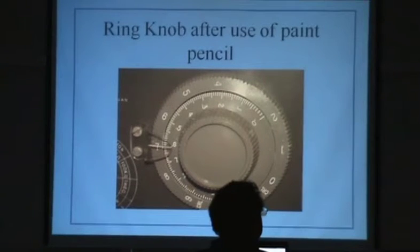I didn't get this slide into the slideshow, so I'm going to put it up here. There's essentially a heavy, pasty white paint that comes in a tube, like a very thick paste. You rub it across, it goes into the grooves, and then you take a nice soft cloth and gently, don't go nuts on me here, wipe it off, and it'll come completely off and do nothing but fill the spots in. There's one other trick to it, though. Don't touch it for 24 to 48 hours. That's a heavy, thick paste. It needs to dry. That's why you see it in a plastic container here, so it won't dry out on me. You've got to give it a couple of days to dry before you touch it. Just do the job, and then go do something else for a couple of days. What's it called, whiteout?